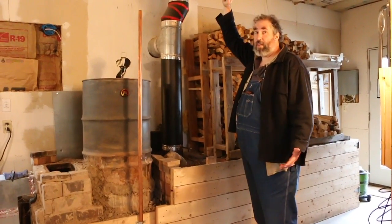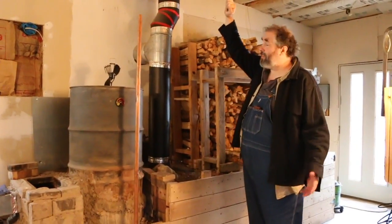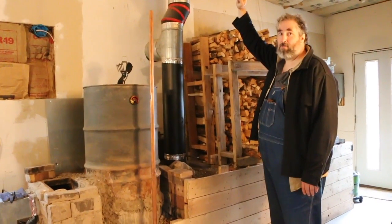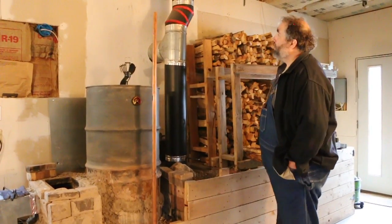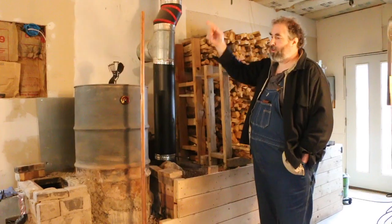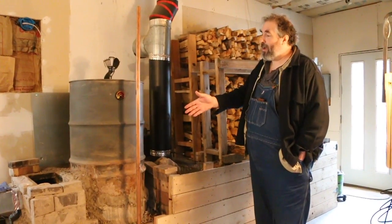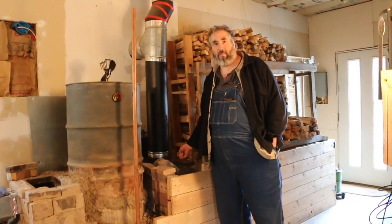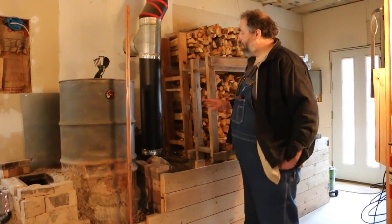With the bypass and guillotine together, we doubled the efficiency of this rocket mass heater — a pretty huge feat, though it was already pretty efficient. But then human discipline steps in, and people really don't have human discipline. Someone would come along and try to start a fire with the bypass closed, and in two or three minutes smoke would start coming out. Other times, the bypass would be activated and the room would suddenly get really cold because the mass never got heated — all the extra heat just went right out the chimney.